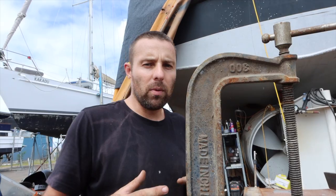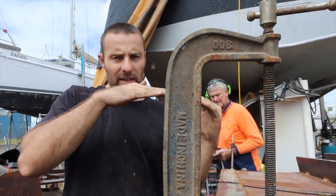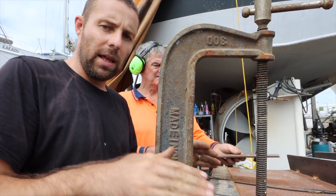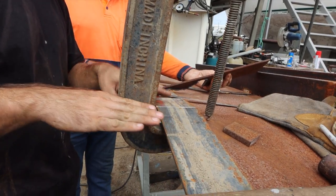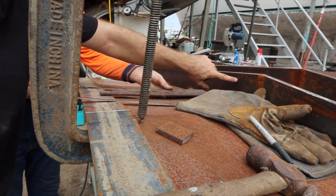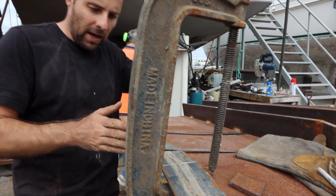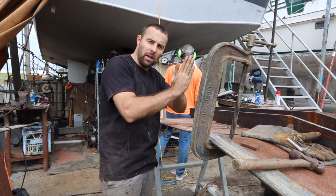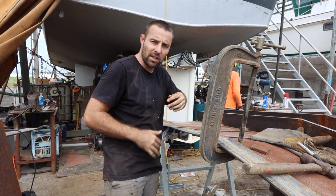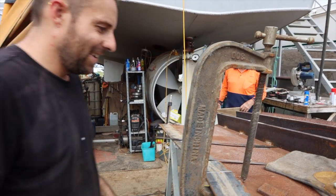The trouble we're having is we've got it aligned at each end, but the center's not right. So we've got to basically wedge it out, and by doing that, it does two things. It makes this surface here flat and parallel, at a right angle to this structural beam here, which is what we need. But it also means that the trailing edge is even all the way down the wing. If we left it, it would go in at the center and then come back out at the hinge end. This is awesome. Look, you can actually see how ginormous this thing is standing next to Damien.